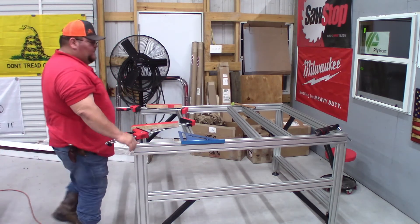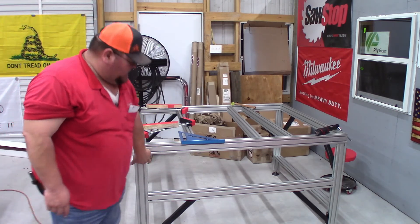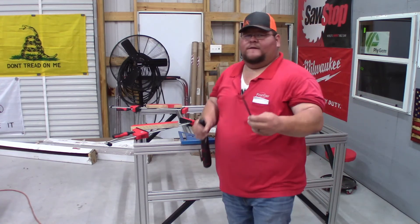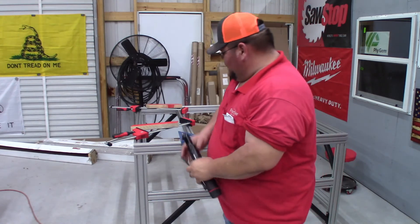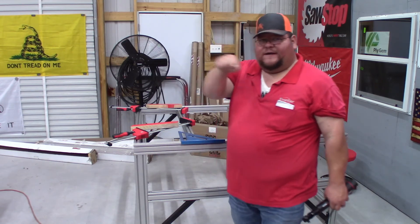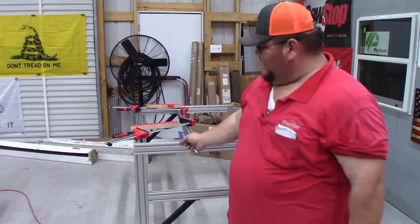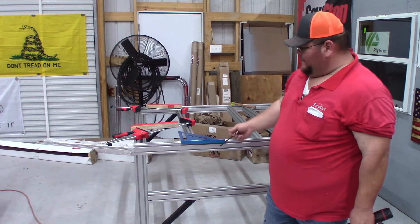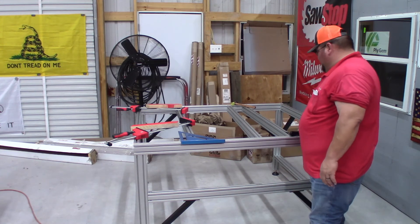Welcome back — we got these pieces put on. I had to lower that down in order to get to these bolts because with this in place you can't get in there. I recommend getting a set of metric allen wrenches. If you don't want to have to loosen and lower it back down, the only way to get to that to tighten is with an L allen. This is a 6-millimeter ball nose — you need ball nose because you will not get to any of these without a ball nose tip.